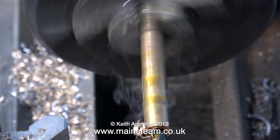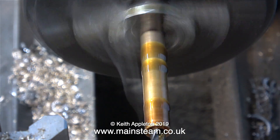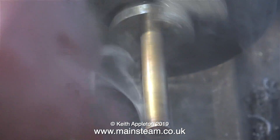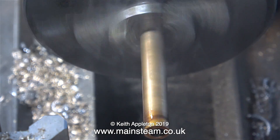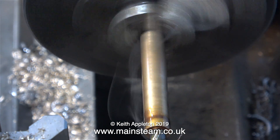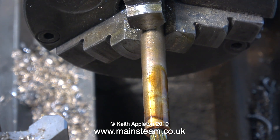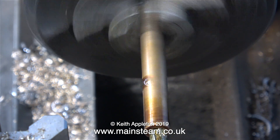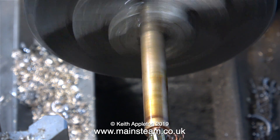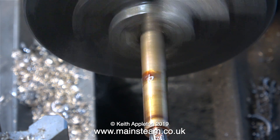I would never recommend drilling the hole all the way through to start with. This time I haven't turned the outer diameter first. I center drilled the end of the work as usual, then using plenty of oil and a three-sixteenths of an inch diameter drill I drilled all the way through with that one first, and whenever the work started to get hot I backed off and waited. I used three sizes of twist drill in total, the last one being one imperial size under a quarter of an inch. Now it's time to ream the hole - the lathe is slowed down in back gear, using plenty of oil, advancing the reamer positively. It's not getting very hot now but it is still getting a bit warm.